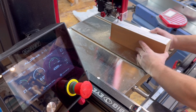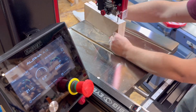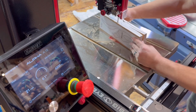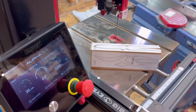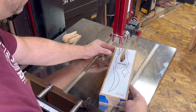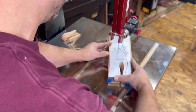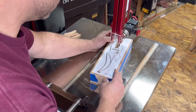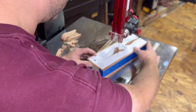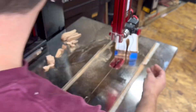One of the things I was waiting to do was cut one of these patterns where you put it on a block of wood and cut it out. I got this one from my friend Pierre-Luc at Brique Logique — he's a Canadian guy who sells these patterns and they are fantastic. The pattern tells you the size of block you need. I used spray glue, put it on, let it dry, and then taped off one side after cutting. One of the things about the Harvey bandsaw is that the larger wheels and bearings allow steeper cuts. The blade I have is a quarter-inch, but a scroll saw blade at 3/16-inch would allow much steeper curves. No matter what blade I used, it was a lot of fun, and I think the Harvey bandsaw made a huge difference because it had the power to do what I couldn't do before.